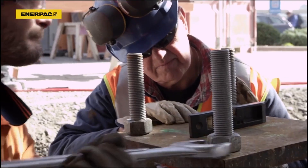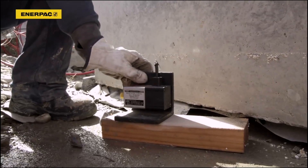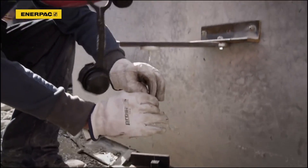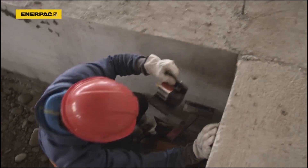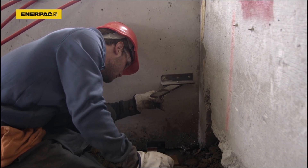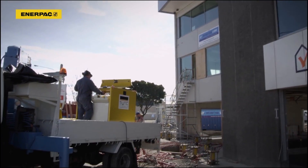To correctly manage the cylinder forces, the lift stools are leveled to provide the correct reaction. The crew attaches draw wire stroke sensors to each of the lifting positions. The EVO system uses displacement information measured by the stroke sensors to maintain a synchronous accuracy of all positions to less than one millimeter.